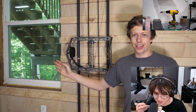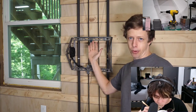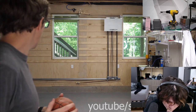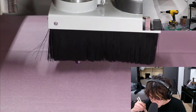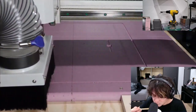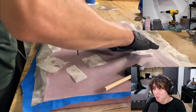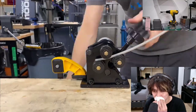Seeing this thing intercept the ball is the best feeling ever, but it's only half the system. Still need a backboard that can tilt with a rim on it. Testing was done without it because of how the belts interact. Making it out of super light fiberglass and foam — the backboard core was machined on the Tormach 24R, making it really easy to get inserts in the right spots.